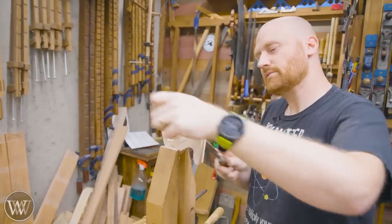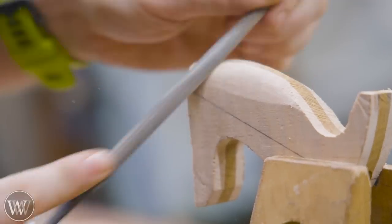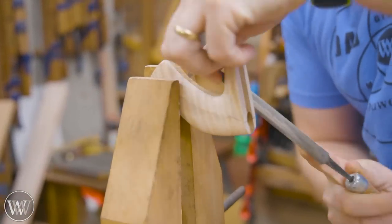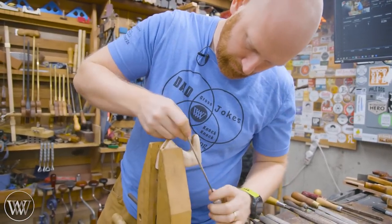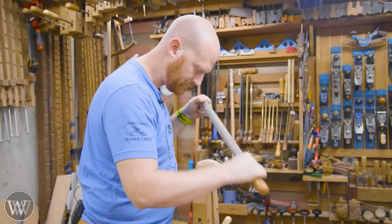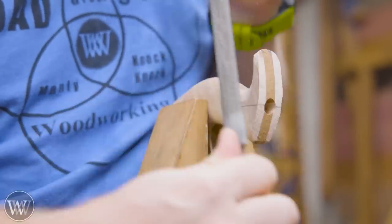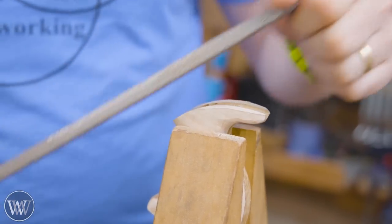One trick is to make the hole in the middle just a little bit larger so that if your holes running from either end meet slightly off, the quarter-inch shaft going through them will still match up. For the actual shaping, I really love this part — I'm using cabinet rasps to take off the majority of the material, and they are incredibly fast. This is probably the quickest way to do it even compared to a Foredom or belt sander. We're going from heavy rasp to fine file, heavy rasp, light rasp, heavy file, light file, very fine file. I love this organic shaping — I'll work on it a bit, take it out, feel it in my hand, then work on it more.